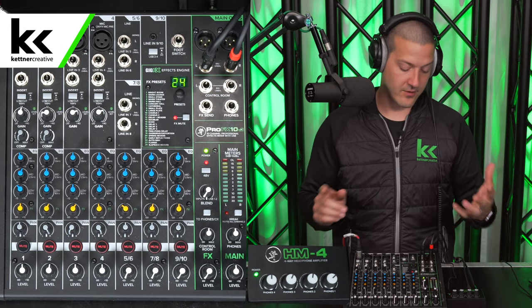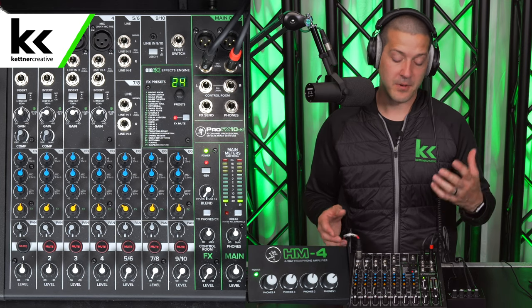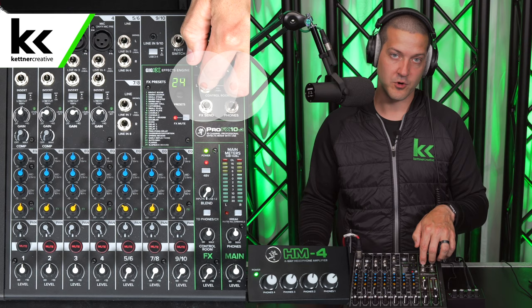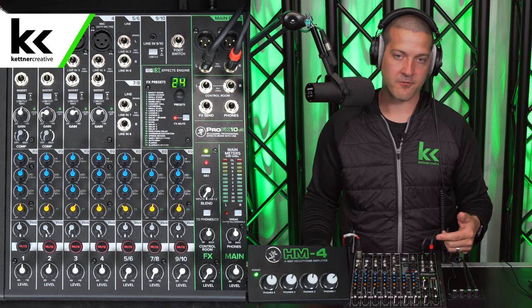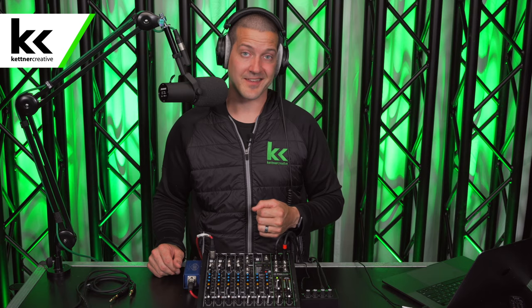Out of all four ways, I prefer just using the headphone jack to the headphone amplifier splitter with a balanced quarter-inch cable — that's the most straightforward. If your audio mixer has features you need for your headphone output, consider the control room or monitor outputs or the stereo outputs — methods three and four. I really don't think sending an aux send, which is a balanced mono output, is effective for headphones — it's more meant for a stage monitor or powered speaker, not a stereo headphone feed. I hope this video is helpful. If you have any questions, ask in the comments below, check the description links for pricing and cables, and please like and subscribe. Thank you for watching. See you next time!